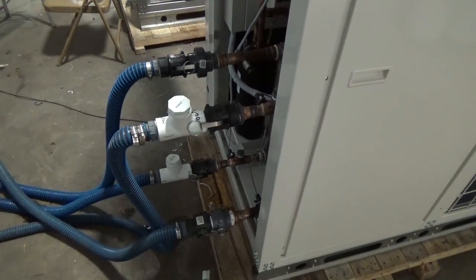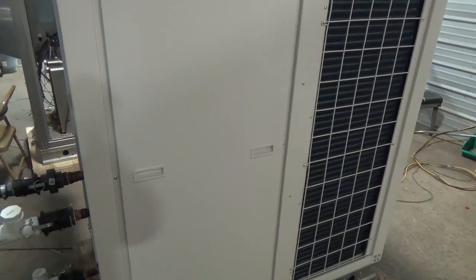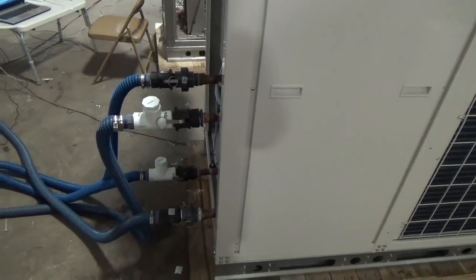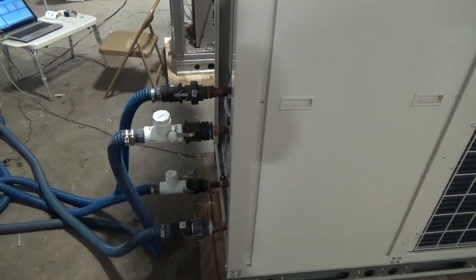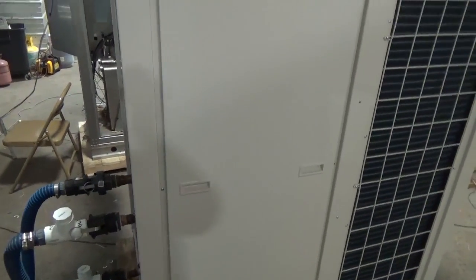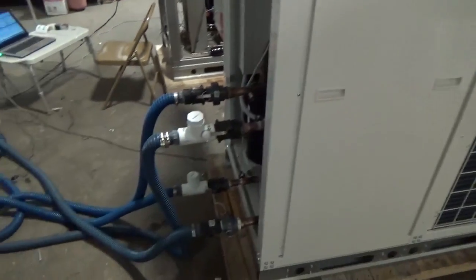I was filming it in simultaneous heating and cooling, individual cooling, individual heating — watching the amperage to see that in all modes I would be able to run this off one of our solar systems. This would replace all heat pumps in a typical American home running heat pumps, which is what I see mostly in the south. COPs over seven — you've got to be kidding me. Couple that with solar and it's going to be fun. Maxed out, I'd be able to run this on my Radian 8048A no problem. This unit is UL approved — this test unit is going out to Intertek.